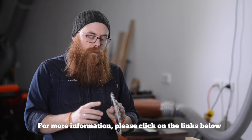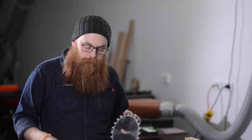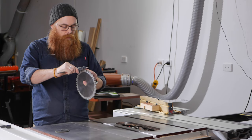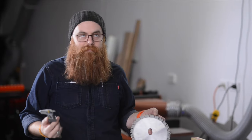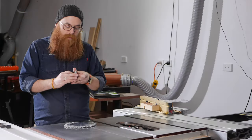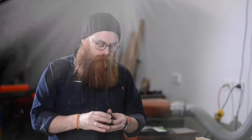Because the blade itself is narrower than the teeth, they won't actually line up properly, so you will need to shim them out. When figuring out the amount of shims you need, I find it most convenient to put the blades together offset and then measure what that gap is. In this case it is 8.34mm, which means we need to make up 1.6 millimeters in our shims. This pack of shims has little numbers printed on it with the actual width. Conveniently, this full pack is 1.6mm — they thought that through.